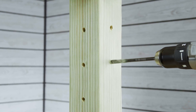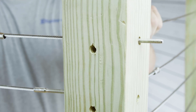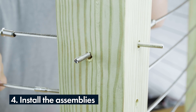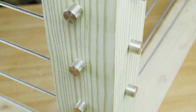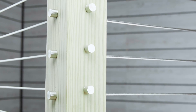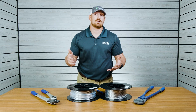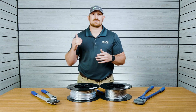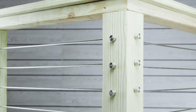What you should end up with are two perpendicular, partially intersecting holes. Grab your swage studs, which should be attached to the end of your cable, pass those studs through the post so that they'll be stacked on top of one another, and then continue on installing those swage stud assemblies as you normally would. The reason for the 3/16ths offset is because the two components have quarter-inch threads and cannot stack on top of one another in two intersecting 3/8ths inch holes. By drilling one hole slightly offset, you'll have plenty enough room to crisscross your components inside the post, and it'll be virtually unnoticeable.